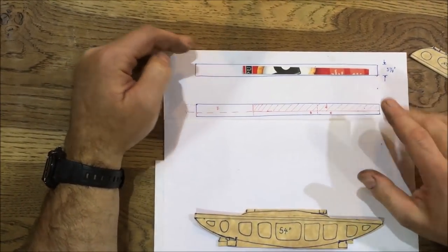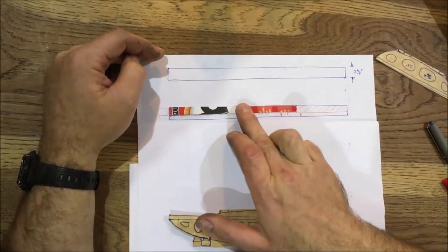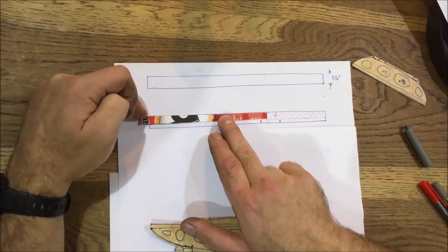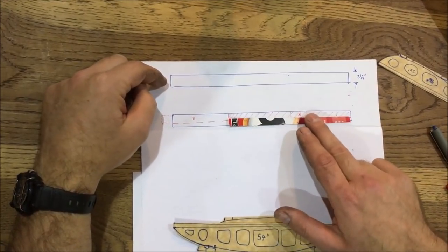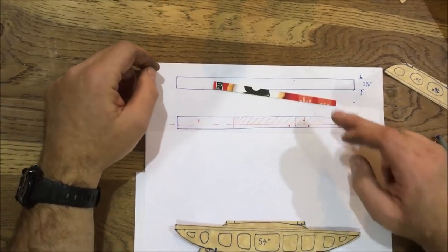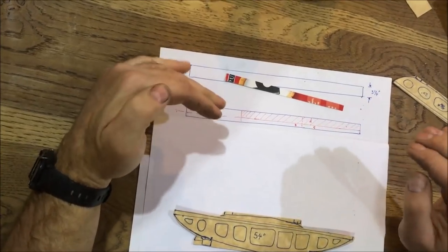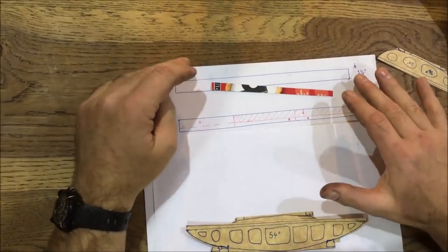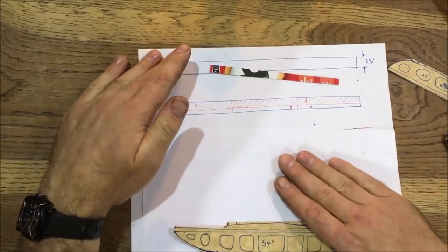So initially it was overlap prints, so print it there, then print it basically there, and I'd got to allow a couple of inches past the end so that I didn't leave a hump on the end of there, and then come back, print it on this side where the majority of it's supported by the already printed surface, and then again there. It was a fairly long drawn out process, but as the distribution of the contact points improved, that printing process got a lot more consistent and my confidence improved.